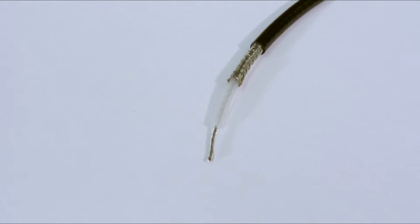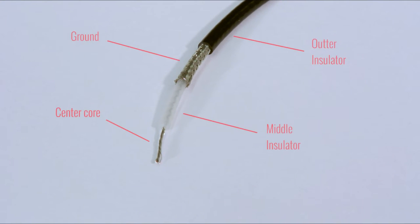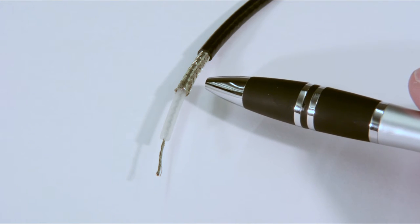Coaxial cables, like these, are mostly used to connect the piezoelectric sensors, which only require two wires. The center strands of wire conduct DC voltage and signal, while the middle part of the wire acts as a ground and a shield. The outer jacket is made of plastic vinyl and is damaged by heat over 175 degrees Fahrenheit. Remember that when the outer jacket is damaged, the middle part of the cable can easily short or ground to the airframe or engine. While this type of cable is relatively inexpensive compared to the twisted pair type of cable, its larger size does make it harder to handle, especially during colder weather.